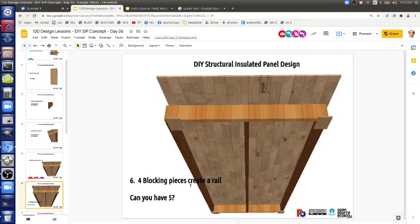Okay. Can we standardize the blocking on front? Like put the fifth one on front so you can. The amount of blocks is just how robust you run. You can't reach it if you're on a second floor. You'd have to be on scaffolding there. The house is designed to be buildable without scaffolding. So you can take the panel on the second floor and tilt it up. If you have blocking on the other side, there's no way you can reach it. You cannot, you'd have to have somebody else on a ladder on the outside. But you can put a piece of blocking on the inside.